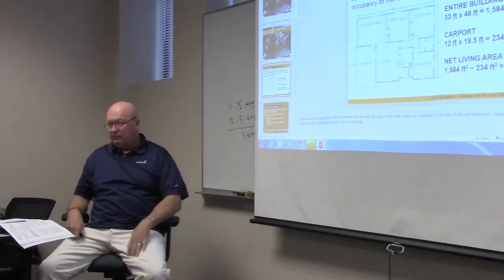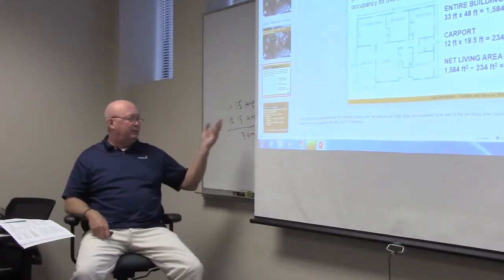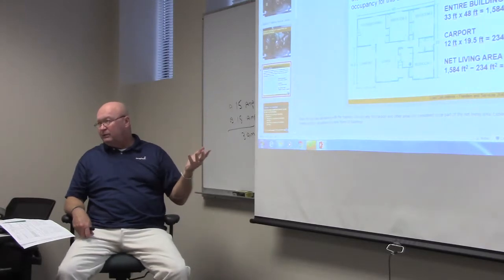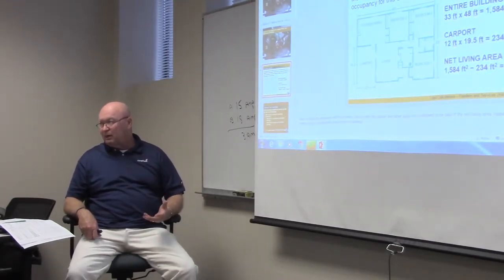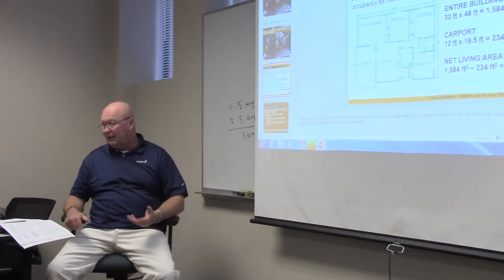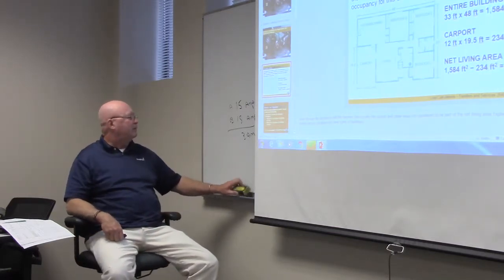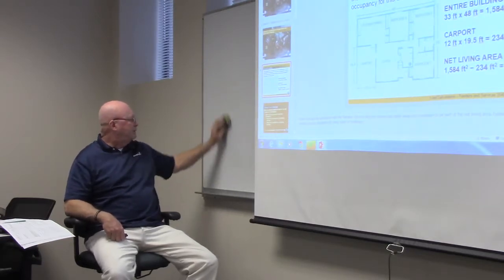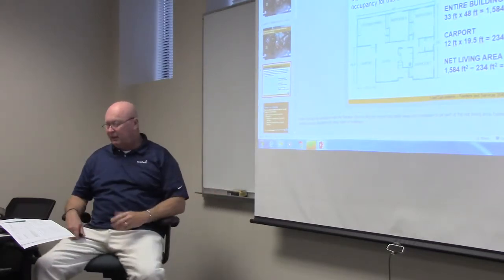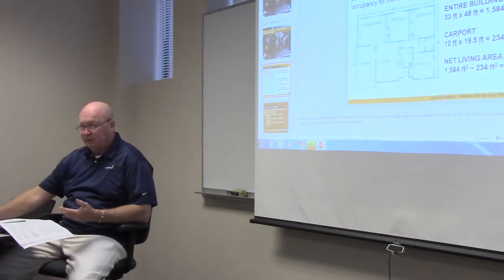That's what we mean by the unbalanced, whatever the difference is between the total load between A and B. And of course, three-phase, you'd have three legs, wouldn't you? But on a simple house, you only got two hots, right? And is your load probably gonna be balanced? Probably not, is it? Okay. So that means your neutral's probably gonna be what? A current carrying conductor, for the most part. Because the chances of you getting it perfectly balanced are about slim to none. And if it did, it probably wouldn't remain balanced. Something would cause it to change when you turn something on.